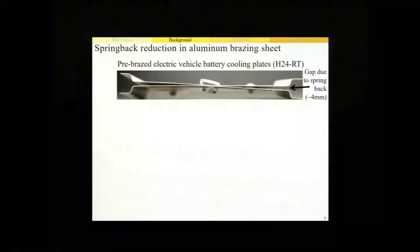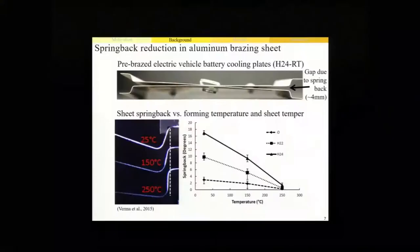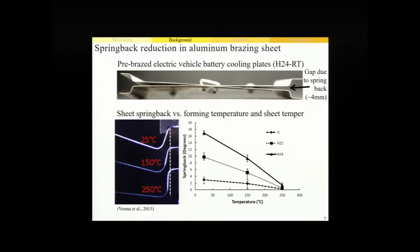The second major forming issue found was that when forming sheets of higher initial strength, the sheets suffered a significant amount of springback which led to poor component flatness and dimensional control. For the heat exchanger assemblies this means large gaps forming on either side of the assembly, making the formation of braze joints at those locations difficult to achieve. My colleagues showed that by increasing the forming temperature we were able to significantly reduce the springback, and this is particularly true for the higher initial strength sheets such as the H-temper sheets. So warm forming seemed a promising technique to expand heat exchanger design possibilities and enable the use of sheets of higher initial strength.